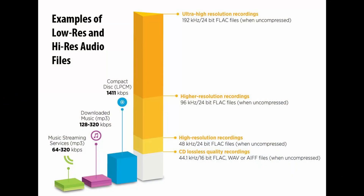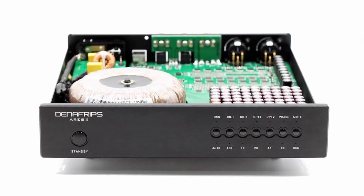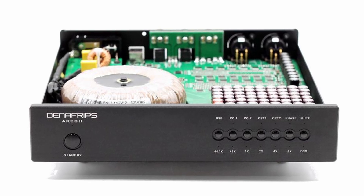There are three things that you ideally want from a digital signal transfer. The first is lossless bit-perfect transmission. That's pretty much buttoned down these days as long as you use a USB connection and your music is encoded in either WAV, FLAC, or Apple ALAC codecs. The second thing is that you want the electrical noise to be as low as possible — noise picked up by RF, other EMI, or noise generated within the circuitry itself.